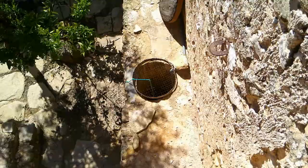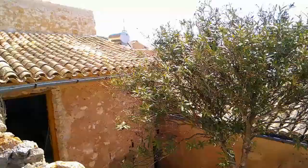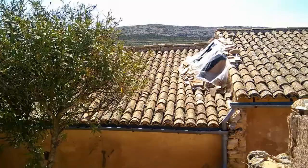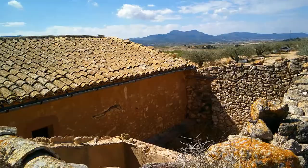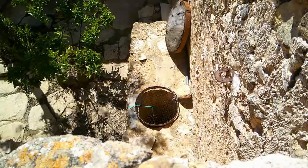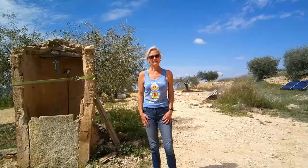The first deposit is in the courtyard and we're looking at it from above. This is where rainwater is diverted off the roof. We only collect water off about half the roof, which is 100 square metres in total. Starting on the left, the apartment roof, that's the main house roof and the workshop roof. You can see the gutters there - they come down a pipe that goes directly into the well. The well holds 7,000 litres. And if we get average rainfall, which is about 300 millimetres a year, that should give us around 30,000 litres.